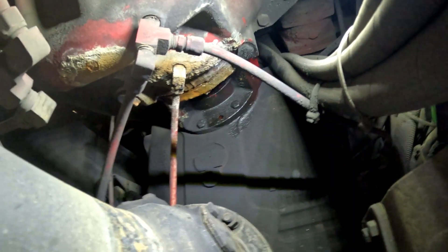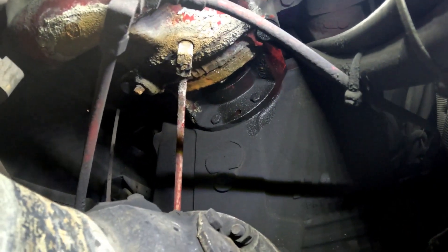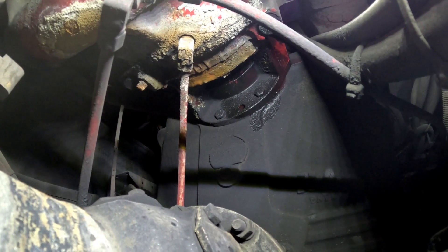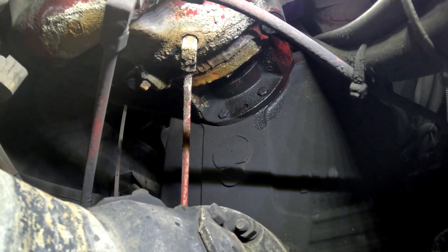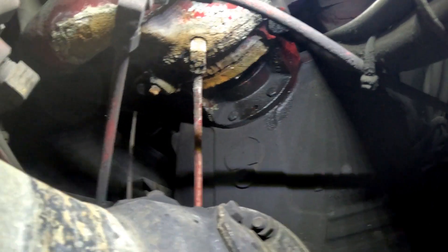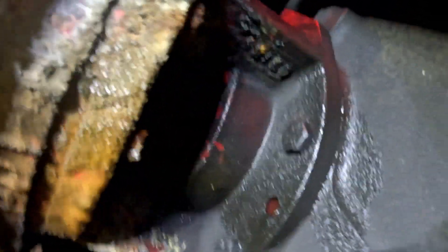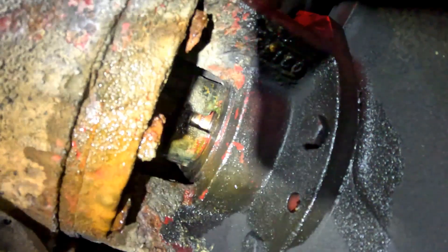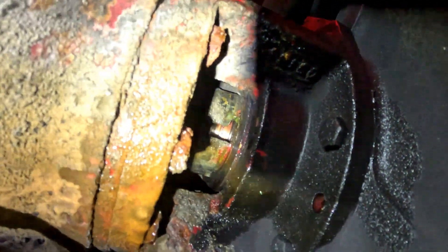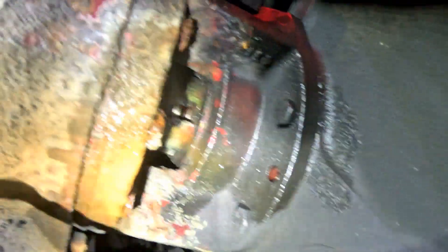Here is the pump transmission and pump. As you can see there's a steady drip coming out of it — you're not supposed to have that. What we're going to try to do is adjust these packings up. Up here is what I call the bird cage — that's where you adjust your packing. The left side is the pump side, right side is transmission.